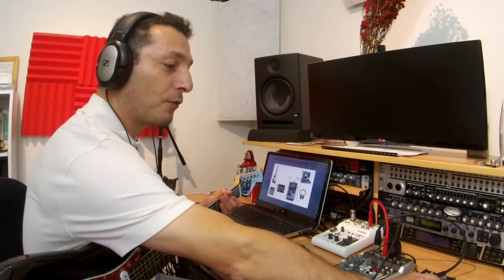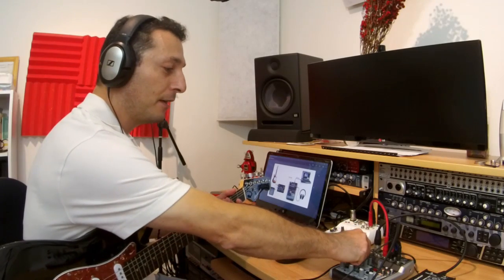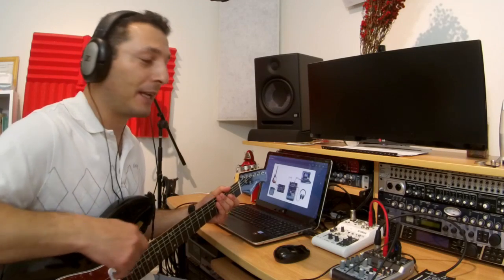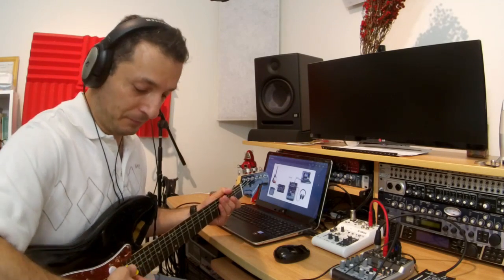So let's give it a try by using the attenuator setting at -20 dB. As you can see now, the volume has dropped down dramatically. Let's increase the input gain at 3/4. That means that sort of gave us about probably 12 dB gain there. And now at maximum input gain for the channel, and I can hear the noise quite loudly. And that's sort of giving the same thing.